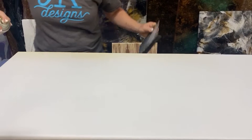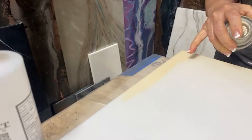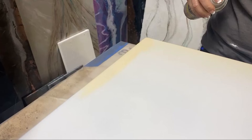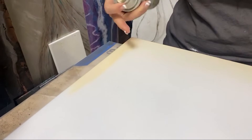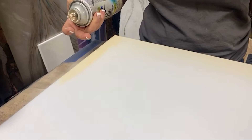This is what I don't want you guys to do — I'll demonstrate it at this end. Don't do this. See that hard line right there? You don't want to do that. That's going to kind of penetrate through to your finish if your finish is not really opaque.